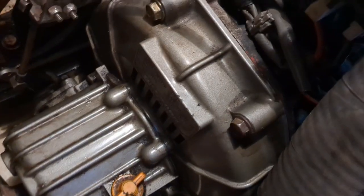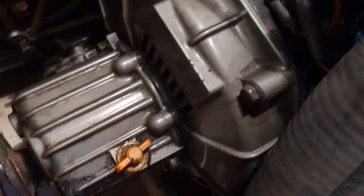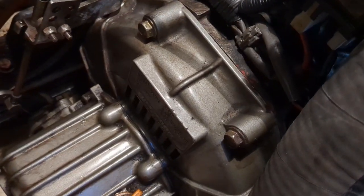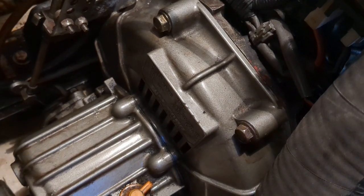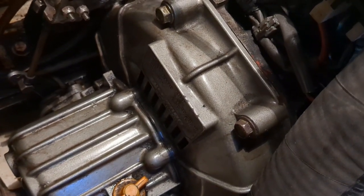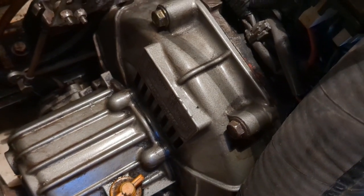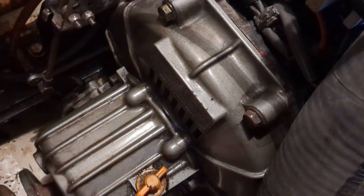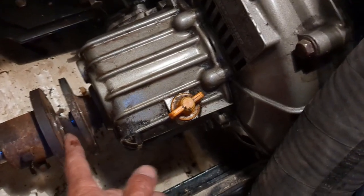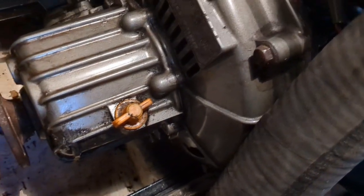So this is it. 2 days. The biggest problem was just space, and sorry about the knocking there. Space and getting the parts in. Lifting the flywheel on was probably the hardest part of the job. And of course, lifting the motor out to make enough room to be able to remove this, because, as you can see, I only had 3/4 of an inch here or so, and really you need at least 3 inches to be able to get everything apart.